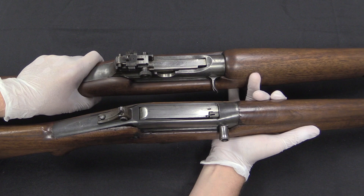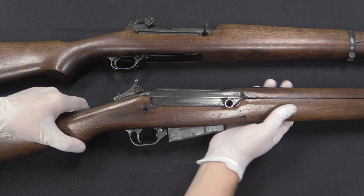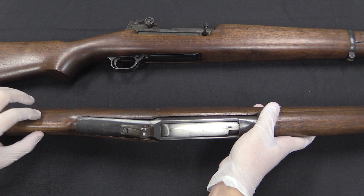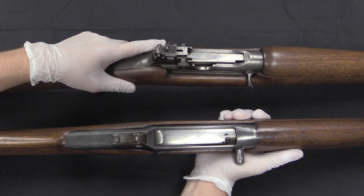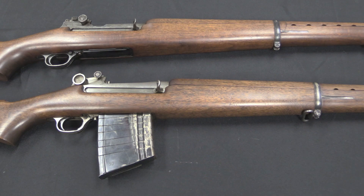The bolts lock up right here — they're both tilting bolts. They've made the receiver a bit bigger up here. One of the other interesting things is that the surviving prototype G30s from the Browning era, where they have this annular gas piston, the stocks are all trashed — they're all cracked up — both back here at the wrist and here on the side. With the G30M the stocks got substantially wider. When you handle the guns it's really evident that the modernised model is really substantially heavier. And at the same time these guns went through a bunch of testing and the stocks aren't cracked up.